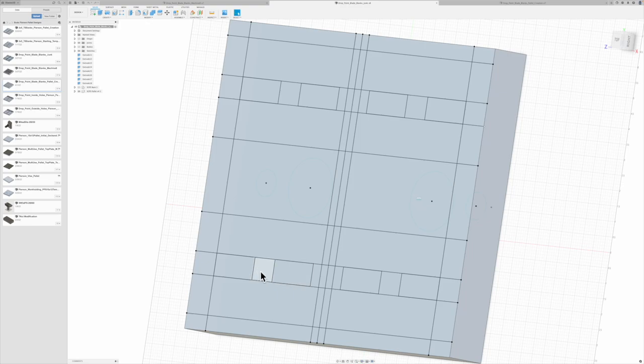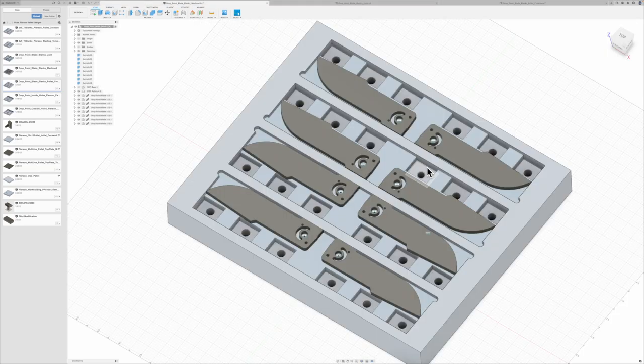It was only going to be able to get 2 clamps on there, and using the formula that Pierson recommends, take the width of your clamp, multiply that by 3, and that's how often you want to have a clamp. So for a 3/4 inch clamp, that means you want a clamp every 2 1/4 inches. I've got a 5 inch piece, so ideally I should have more than 2 clamps on there. I wanted to get to 3. This wasn't going to work for me, so I came up with a different design.